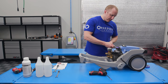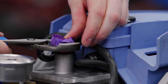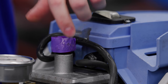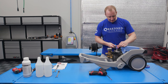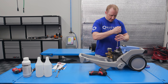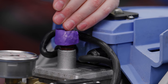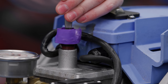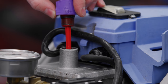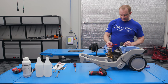Once you sort of break this free, it will untwist by hand. Just mine is super tight. The recommendation is to change the oil at 50 hours and then theoretically never again — I wouldn't recommend that. I'd recommend changing it once a year or so. You should get some towels. So that's what the dipstick looks like, and our oil looks good.